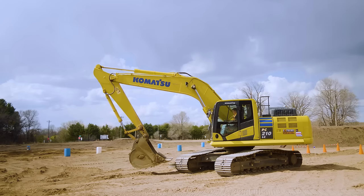And then I'm out there. So that's digging. And then real quick on some backfilling, same concept, just reverse. So I'm gonna take some scoops out of it. The difference here is you don't necessarily have to raise it. You'll see these things don't have a ton of lateral force, but if I raise it up a little bit, you can kind of swing material over as well. So I'm kind of scraping through it. And I'm swinging at the same time.